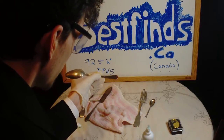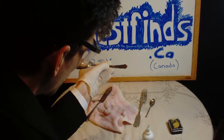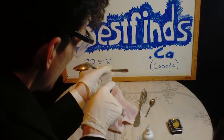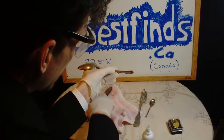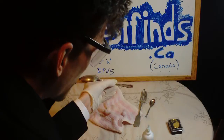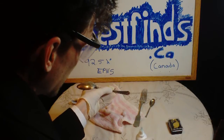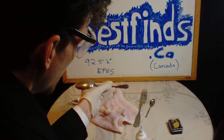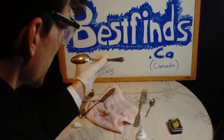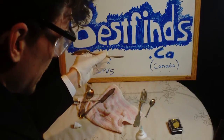Look at the color — it's turning a brownish and there's a lot of red, deep red. And then blue. So you see that red? That's silver. EPNS — because we knew already from the stamp. We get a dark brown, dark muddy brown. And once it digs through, we get some blue right on the edge there. You can see it's going to keep turning blue as it digs down into the copper. Very cool reaction to watch. I hope there's enough light so that you guys can see it. And now I'm going to neutralize the acid.